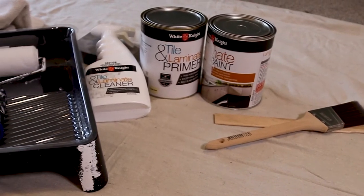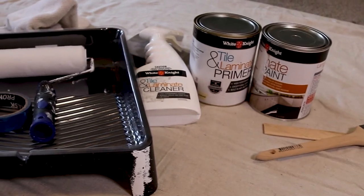Once I've primed it, two coats of top coat. Really important to remember here — one of the most mind-blowing moments for me years ago — you can get all these tile and laminate paints tinted. So this is going to be a gorgeous soft pinky apricot. And importantly, we need to make sure we clean it well. So: sand, clean, undercoat, two top coats. I'm going to show you exactly how I do it every step of the way so you can pull off one of these conversions with White Knight at Home.